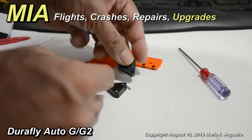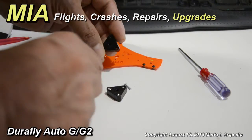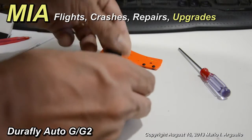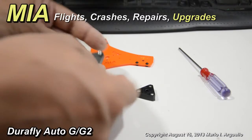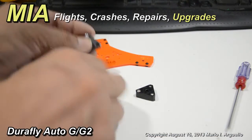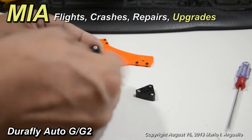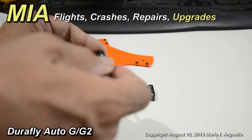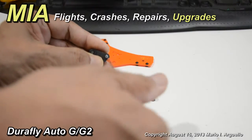These plates are the same — they have a pocket on each of the corners. Whether you use the top or the bottom doesn't matter. Whether you press fit the nut on one plate or the other doesn't matter. Take one of the plates — the one without the nuts — and insert the screws. The screws should sit inside the pockets. You can press them with a screwdriver; they will sit inside the pocket once you start tightening the bottom plate.